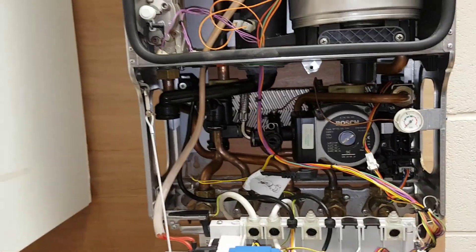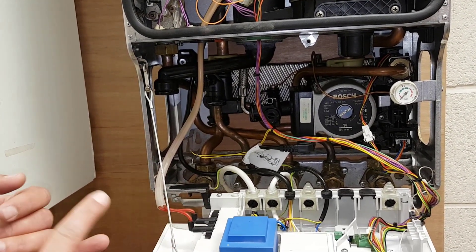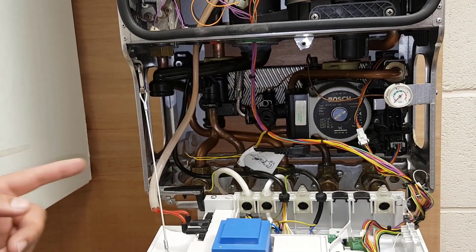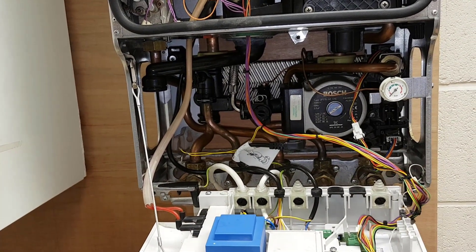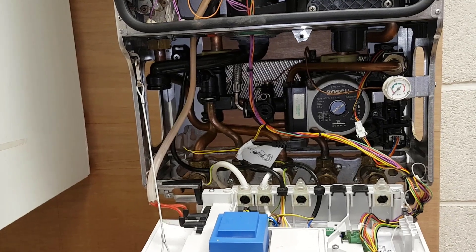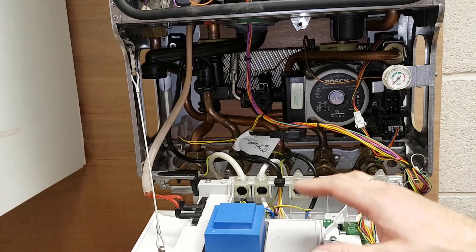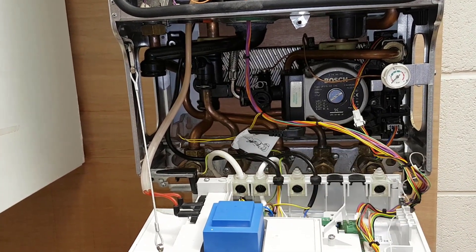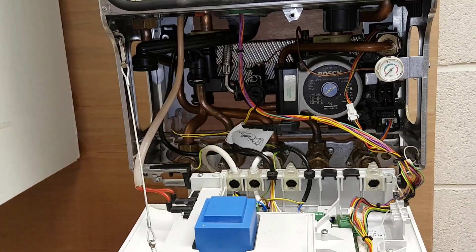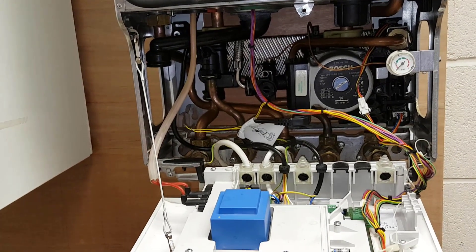That's open, that's open, flow return's open, my hot tap is closed. Electrically — turn the boiler on, turn the power on. Then check electrical safety tests, because we disconnected the power supply. You can do that — you should be alright, but you can do that. So you turn the power on. Then what do you do next?